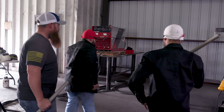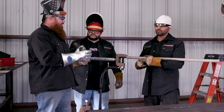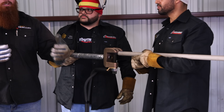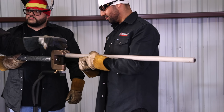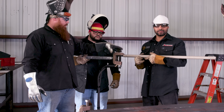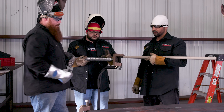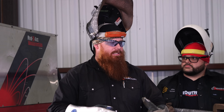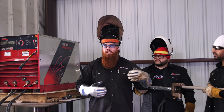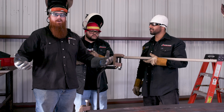We have a four-foot long, three-quarter inch diameter electrode, very similar to a 7018 in nature as far as technique. We're going to use a thousand amp ground clamp that we've makeshifted into our stinger — our electrode holder — with a piece of all-thread that's insulated. This is usually a mechanized process used in foundries to fix their dies and molds.